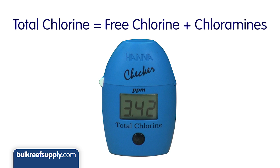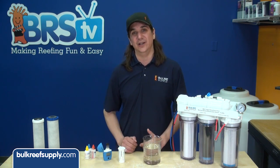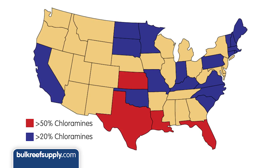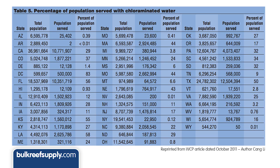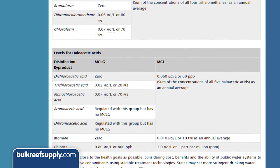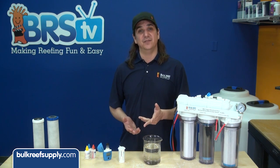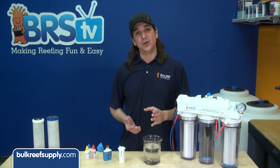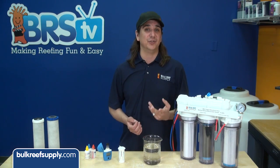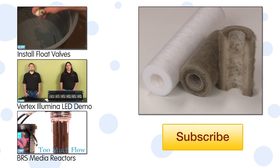Total chlorine, as the name suggests, is the total volume of chlorine in the water and includes both chlorine and chloramines. Testing for free chlorine will help you identify which type of disinfectant your city uses — free chlorine will only show hypochlorite, which most people refer to as chlorine. The other common type is chloramines, now used in an estimated 25 to 30 percent of households, with that number expected to grow as municipalities try to meet new EPA standards for disinfection byproducts. Chloramines are chlorine reacted with ammonia, making a more stable disinfectant, but that stability makes them harder to remove and the removal process results in some ammonia in the product water — pretty undesirable for most reef tank owners. For that reason, most of you will want to find out what your city uses by giving them a quick call.